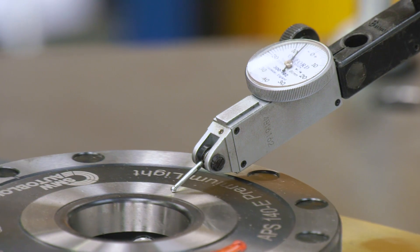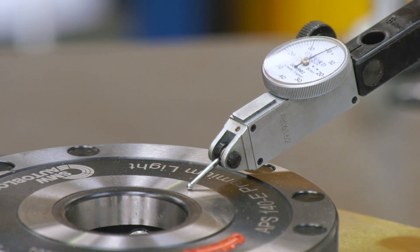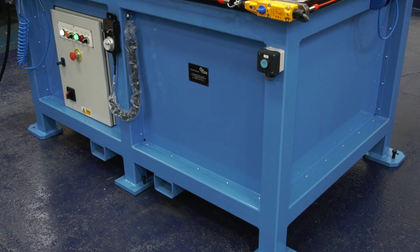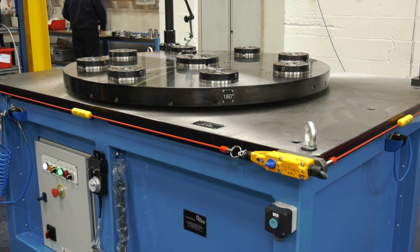Can you explain in a little bit more detail how they work? These particular tables use our automatic positioning system modules, or APS modules. They locate the fixture accurately within five microns. The setting table itself rotates within five microns, and you've got 10 microns on flatness of the table as well.